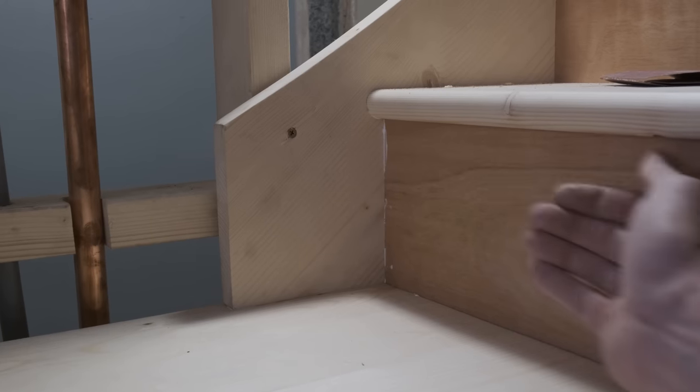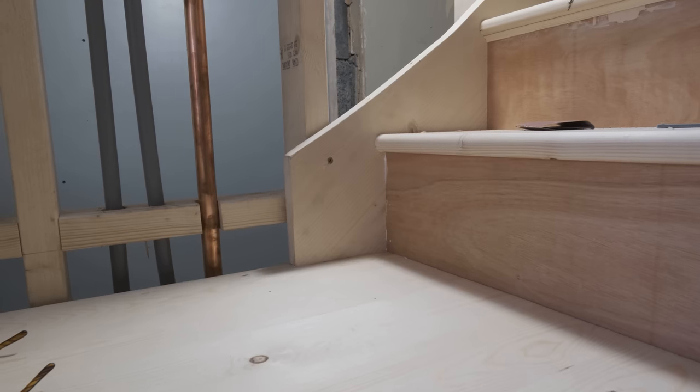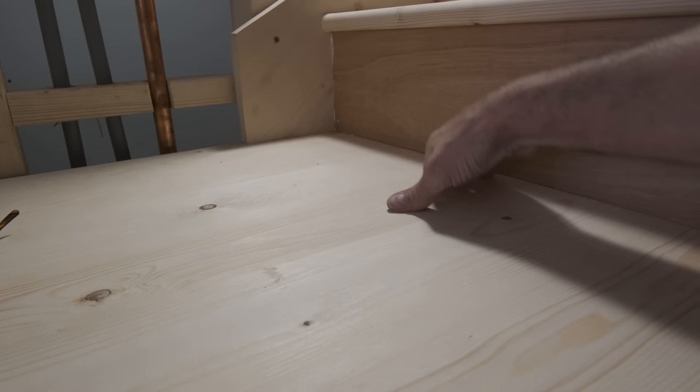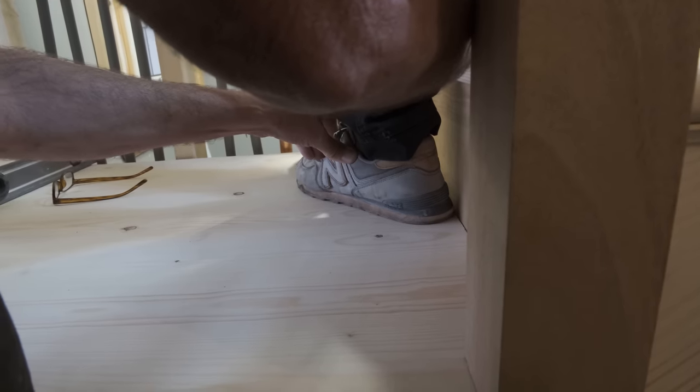That face of the riser now has got it nice and tight, with all that glue squeezing out. Nice and solid then. It's not going to go anywhere. It's not going to squeak as well, and that's the big thing. Ollie's going to stand on this in a minute just to take that little bit of a bow out. Once we've got these two sides fixed, everything will be under tension, nice and tight as well. See the glue squeezing out here? Okay, well, that's it. Go for it, Pete.